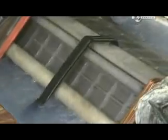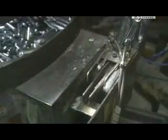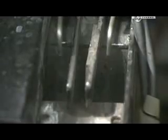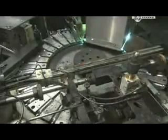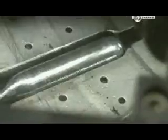The cartridges are inside this revolving drum, which delivers an electrical charge, attracting zinc from the tank to plate the cartridges. The smooth zinc plating doesn't just look good, it's a better surface to print information on. At this rotary silk screening station, the brand name and cautionary information are printed onto the sides of the cartridges. A quick bake under an ultraviolet light cures the ink.